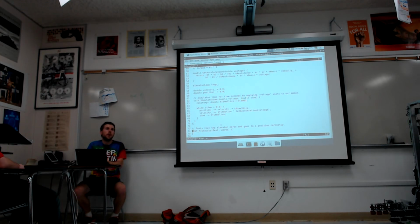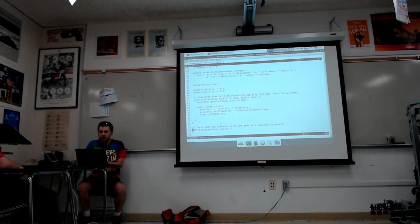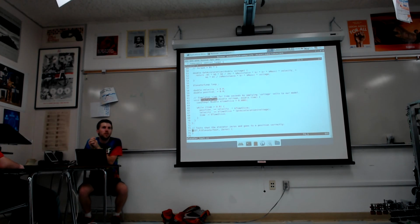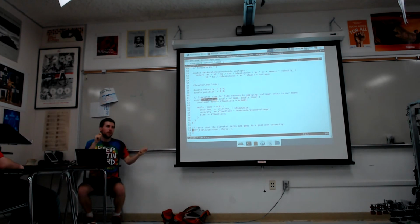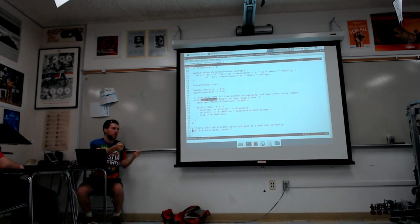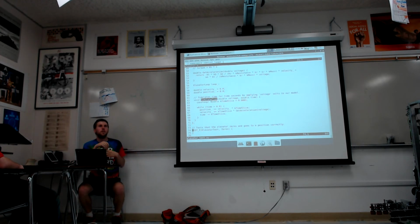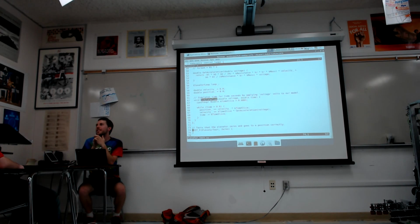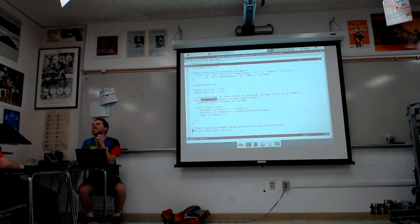Great. So now we want to step out a layer. Now we can simulate a 10 millisecond control loop cycle. We want to simulate what happens when we execute our control loop, then time elapses, and then we execute it, and time elapses again, trying to simulate what would happen in our real robot. People following where we're going? Mostly. What's not making sense?